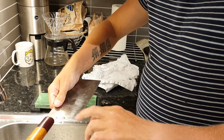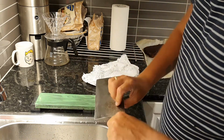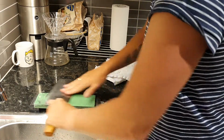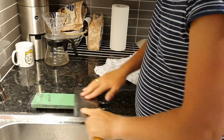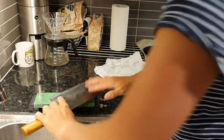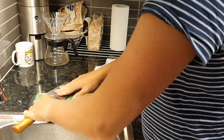See, very near a burr actually. I haven't gotten it, but it's not far from. Just gonna thin the other side so I don't bend the edge, because it's so thin. It's actually quite easy to bend, and I'm gonna do it that way to ensure I don't recurve my edge.